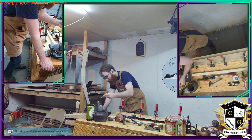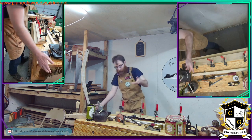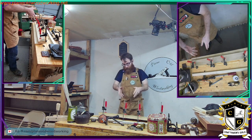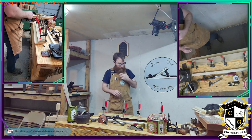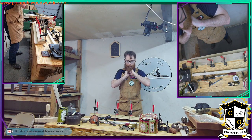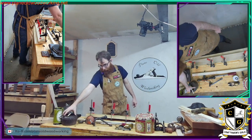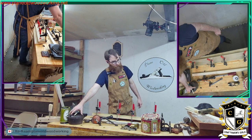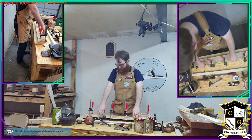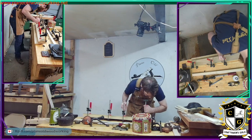But if you've been on my streams before, I use this specific little pot for doing dovetails all the time, because it's just the right amount to glue up some dovetails, get them together, and move on. Or to glue up some rabbit and nail joints and move on. This is more, I'm gluing up an entire carcass. Which is why I knew I could at least get some gluing done and then clamp it to get it to fit together.